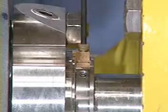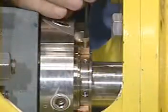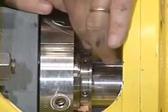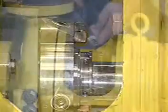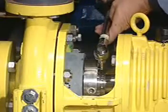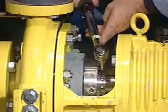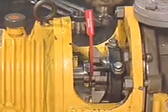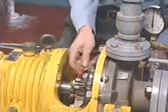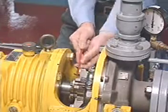Remove the centering clips. The clips should be saved to reset the seal each time the set screws or gland nuts are loosened for impeller adjustments or for other reasons. After all set screws have been tightened by hand, retighten all set screws to the torque value listed in the installation instructions. If the seal comes with a ripcord, pull it away from the seal. This centers the stationary and sets spring compression.